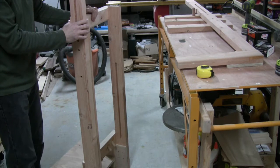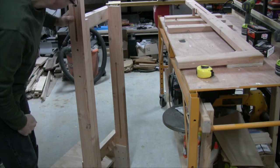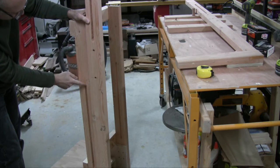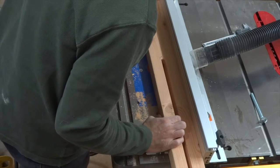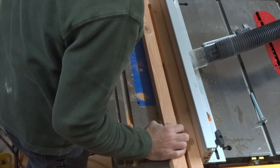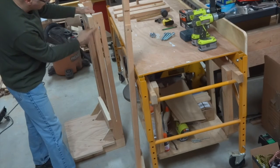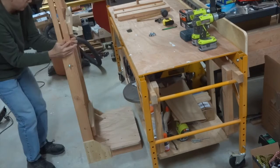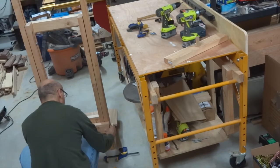As I was preparing to join the platform assembly to the base pieces, I realized that for some reason I did not run the grooves in the platform assembly as far as they needed to go. It was a relatively easy fix though — I just went back to the router table to extend the grooves a little further. After that was done, I was able to get back to assembling the parts. I used some carriage bolts and nuts to attach the platform assembly to the base pieces, and I attached one more cross member to the assembly.